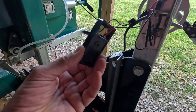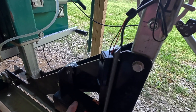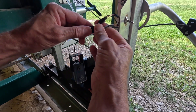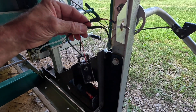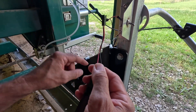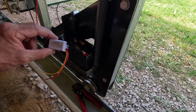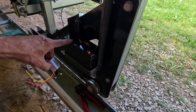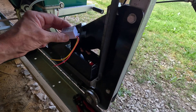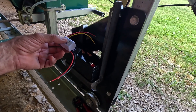This is the original three-volt power source — those AAA batteries I was telling you about. It's just kind of chintzy. So we're going to remove that and wire into this 12-volt battery. We just take it out of this clip, and since it's wired up with a quick disconnect we can just unplug it. Now all we need to do is put this same type of connector end on the 12-volt battery and we'll be able to plug it right into the existing wiring — it doesn't get much simpler than that. This laser operates off three volts DC, and our battery is 12 volts, so we need something to knock that voltage down. I've got this adapter — probably nothing more than a resistor — and we're going to install it in line between the battery and the connector to drop our voltage down.